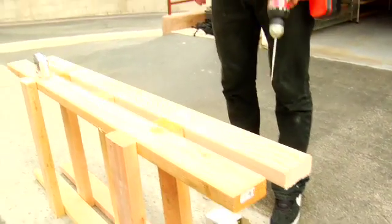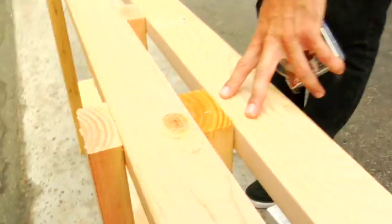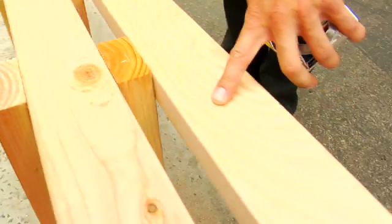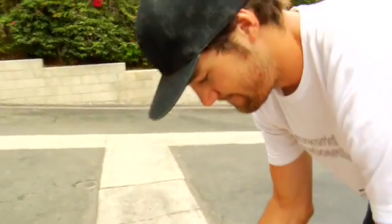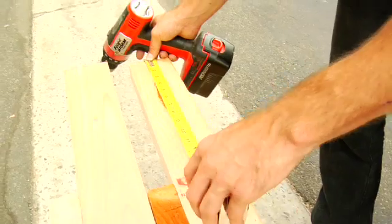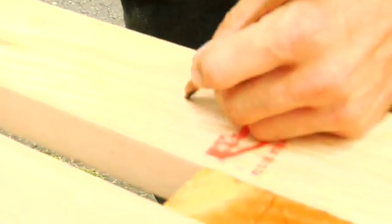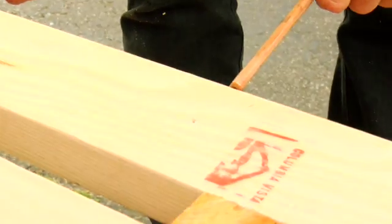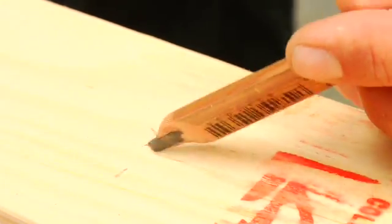So where do you think you'll put them? On this one, we'll go just outside on your ladder with the 3 rungs. We'll go just outside each of these. So a good measurement for that is you can go about a foot in. So that way you'll drill your hole, it won't mess up with these screws. A foot's a good easy measurement. And you want to make sure the holes are nice and centered. So with the 2x4, it's actually 3.5 inches wide. So you want to go 1 3/4 in, and it'll put you right on the money.